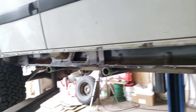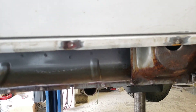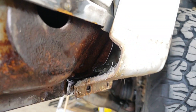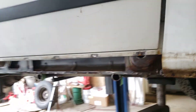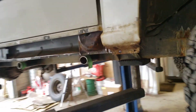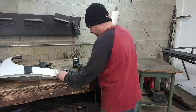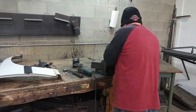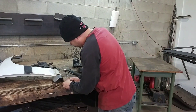Because my customer cut away the rocker panels, I no longer have a line to follow — I don't know what the original rocker panel looked like. So I'm going to follow the line on the fender instead, which is essentially identical to the rocker. I'm working on the driver's side right now, but I'm using the passenger side fender as reference because the driver's side fender is completely rotten on that portion. I'll just flip the template around for the driver's side. I use a handy little pan brake that fits into my bench vise for small templates like these.